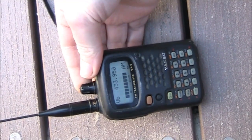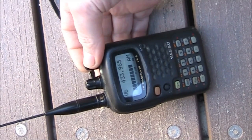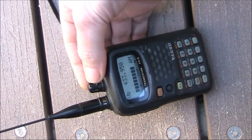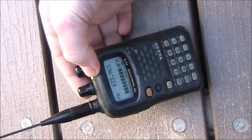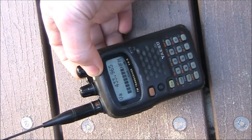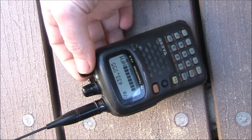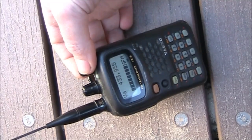Here's it receiving the signal from the oscillator module on AM. Interestingly enough, there seem to be peaks at two frequencies: 433,965 and a stronger one at 433,950. This is it on FM. As you can hear, the signal is fairly quiet, but it's quite audible if you turn up the volume. I'd say its deviation would only be one or two kilohertz. And as a hint, make sure your tuning steps are 5 kilohertz or less — that will help you tune to the clearer signal.